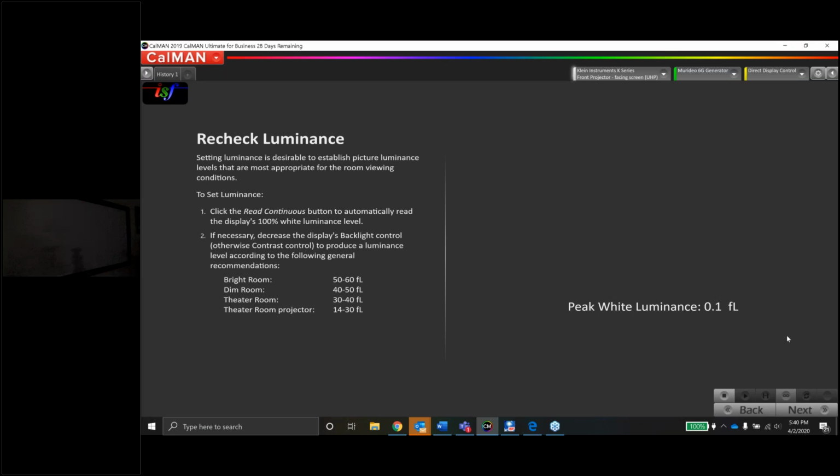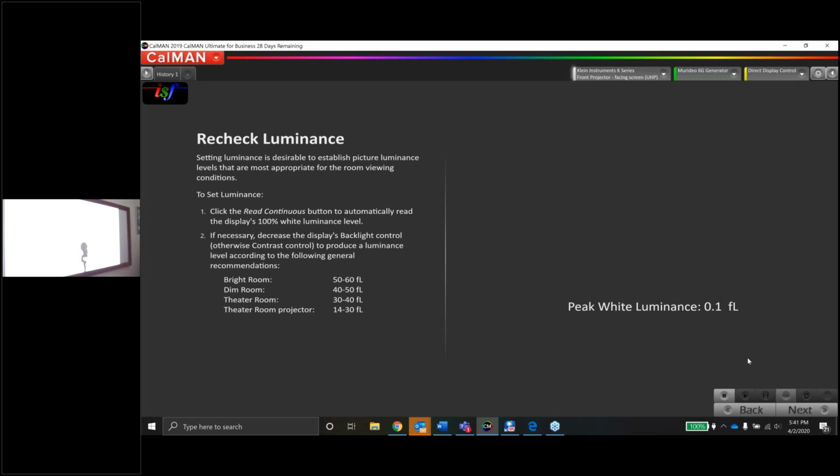And now, once we're calibrated, at least for SDR, we are, as soon as this JVC projector syncs up, come on, test pattern. We're at 39. Maybe we change the lamp back to low, or maybe we lowered the contrast. But 40, guys, this is still 40 foot-Lamberts on an 85-inch screen, sitting 8 feet away. Is really, really cool. Really cool.